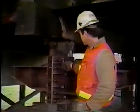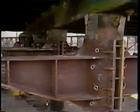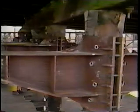Along with the bolt holes on the pile clamps are holes for the placement of lag bolts into the pile itself. This provides extra security to prevent the clamps from sliding down the piling when the bridge is eventually jacked up for replacement of the cap.